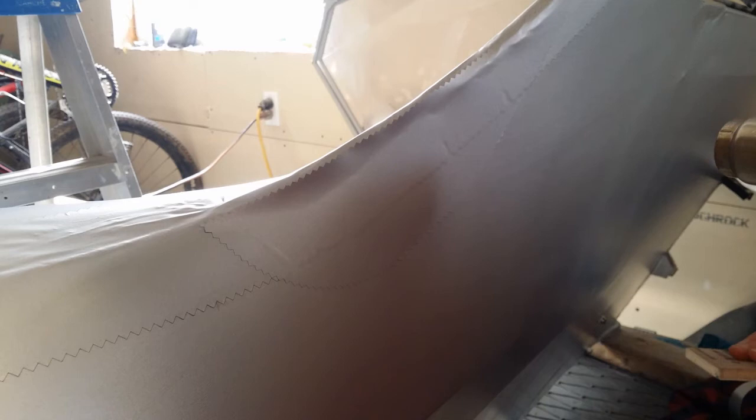Anyway, there's a massive amount of tension at this spot right here, where that compound curve is. And so what we ended up doing is making a stress relieving hole and then putting a patch on there. So here is just some of the pink tape lined up. And here's this patch you can see that we put on, and then this pink tape's partially on right here. So this patch on the bottom here was there to cover that hole that we had to make to stress relieve it. And actually, you can kind of see just through. This is where this hole we had to make that cut is. And then we have the pink tape on top.